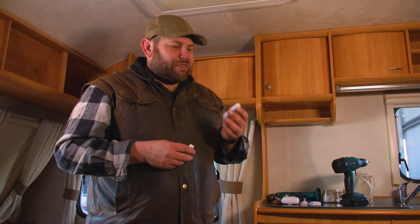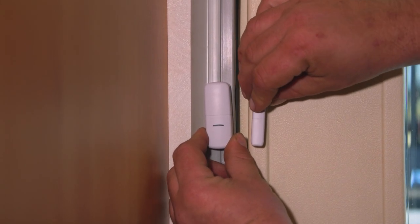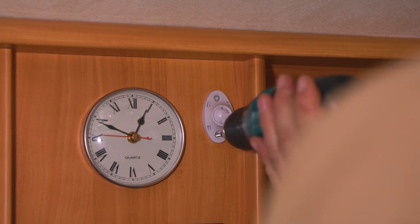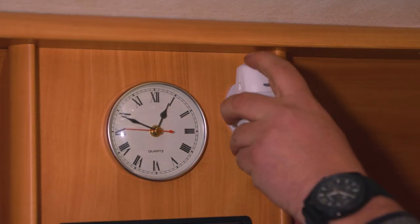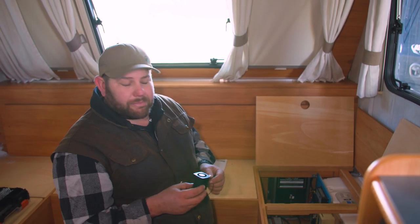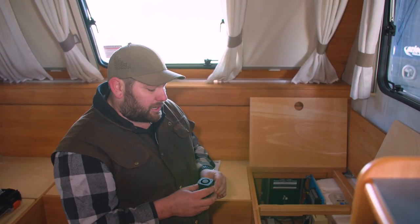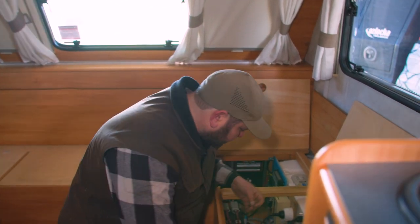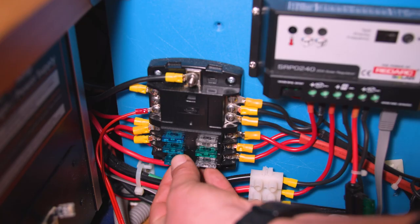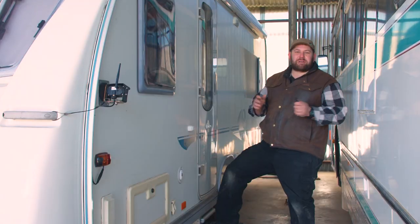Now it's time to fit all the wireless sensors — I'll start with the reed switch for the door. I'm also mounting the siren now. I've chosen to fit it in this compartment box. If it's not quite loud enough, you can mount it outside, but you'll need the extension cable which is available on the website.